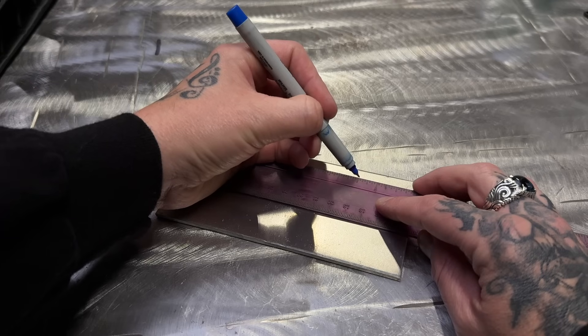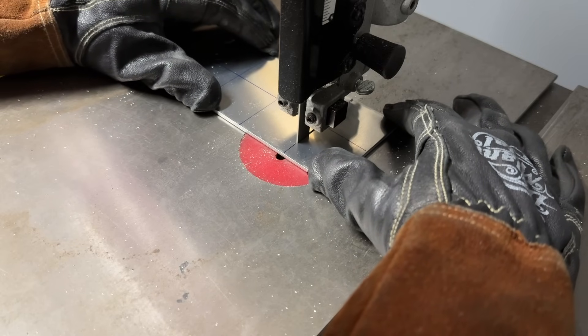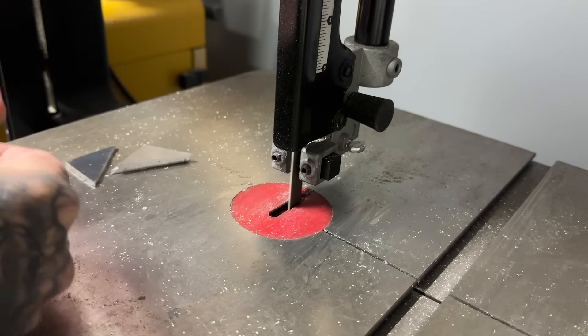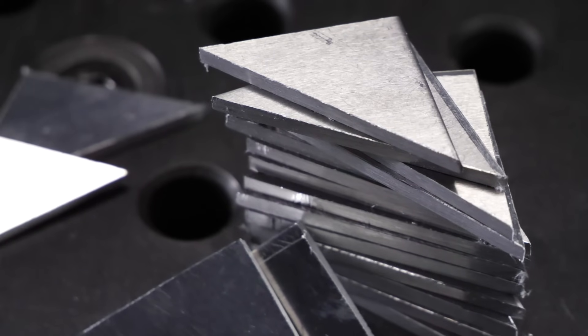What I'm going to do is lay out my plate here. I'm dividing it into eight equal squares so they'll be one and a half inches in measurement, and then after cutting them out I'm going to cut them again across the diagonal to make them triangles. The key is to cut these as precise as you can. If you have little spots that aren't straight then you're going to have to adjust later to get a good fit with the project when tacking it together.